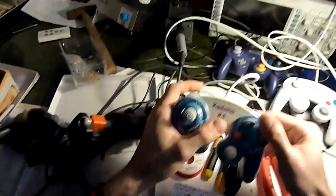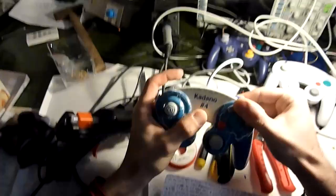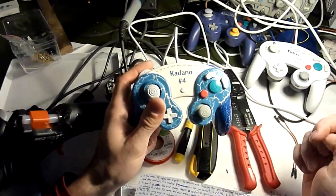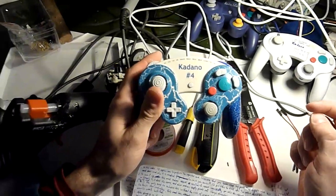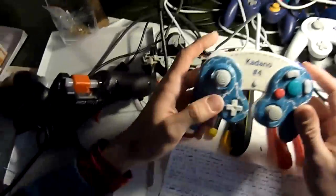By resetting with X, Y and start, you recalibrate the controller and stop the drifting. Now Fox will stay in a neutral position if I don't press anything on the controller. This resetting only needs to be done once after plugging in, so it will never suddenly start to drift mid-match unless you replug the controller.